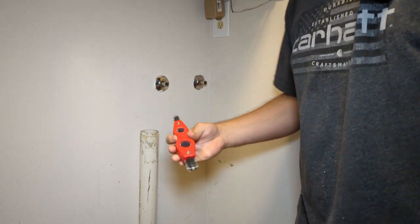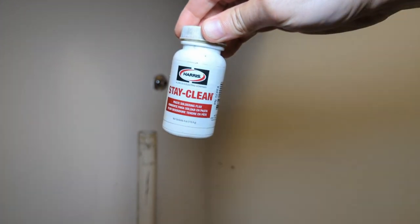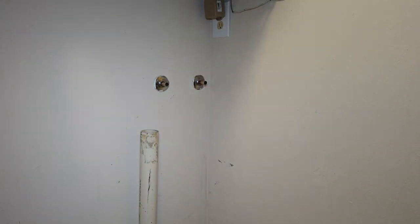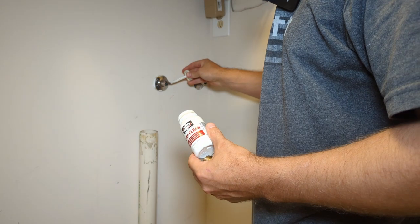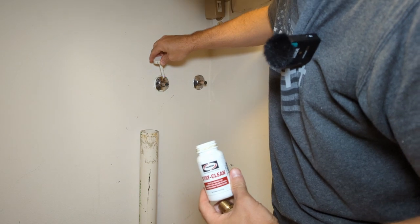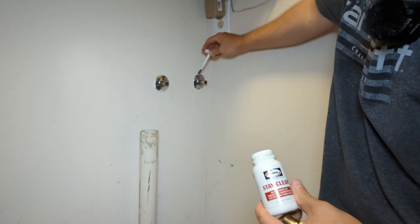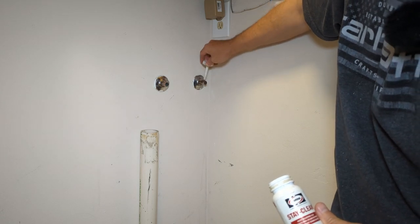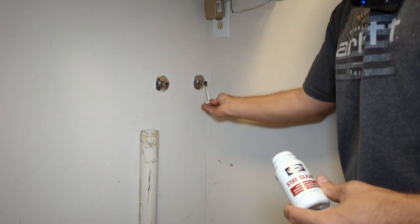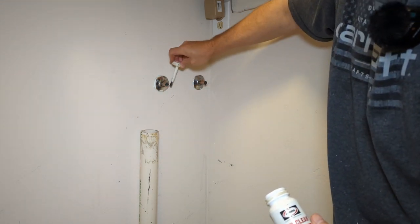Now we'll take some flux and we'll put that on the pipe. I like to use a Harris Stay Bright number 8, and I use this Stay Clean Flux. Again, link in the description. It's expensive stuff, but it's really good. Pretty sure this stuff is even rated for HVAC work. Just put it generously on the exposed clean copper.